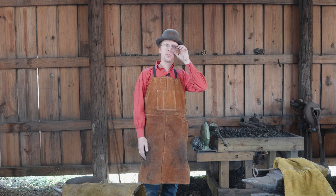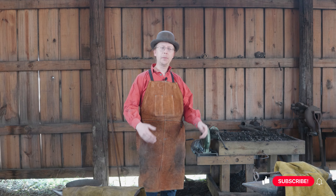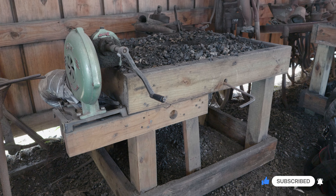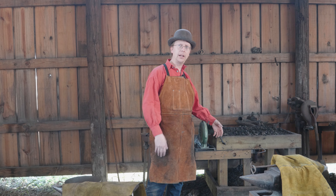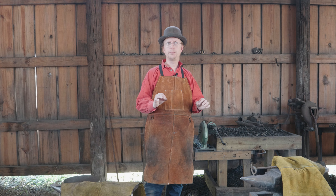Welcome back to Waters Ironworks. We're out on open shop night at Pioneer Farms tonight and I'm going to be building a new forge. It'll be very similar to this one — super simple construction: a couple 4x4s, a frame to hold them together, some angle iron, and then a big steel plate. Cut a hole in it, fire pot drops right into it. An incredibly easy forge for anyone to build if you're looking at building your first forge.